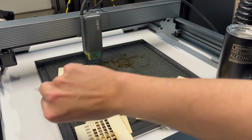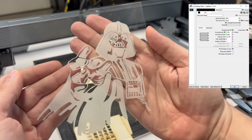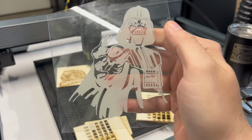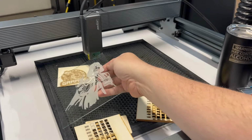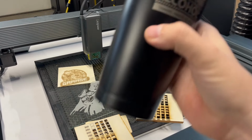And let's go ahead and engrave some glass. Darth Vader. This is their recommended settings, 70% power at the speed of 1,000. Yep, hear that? Totally engraved. I use tempera paints because it washes off just with water. It's very easy to use. No scrubbing.